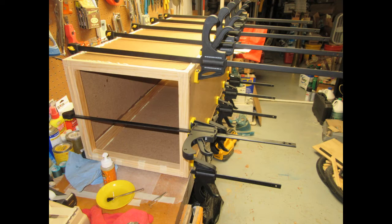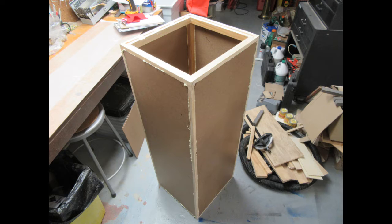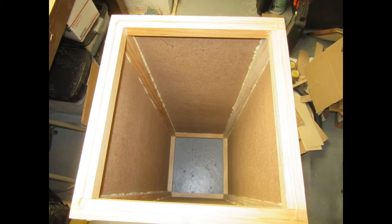After a 12-hour period to allow complete curing of the glue, the same process is used for the other 2 side panels. It is normal for some glue to foam out of the inlays on both the exterior and interior seams. If foam does not come out of the seams, this indicates that not enough glue was used. The idea is that the glue should at least foam to fill the seams where the edges of the panels meet the edges of the frame inlay areas.